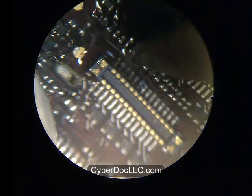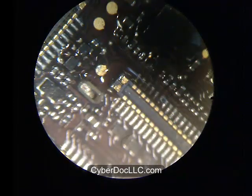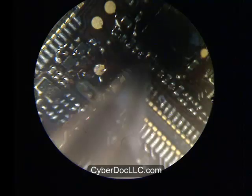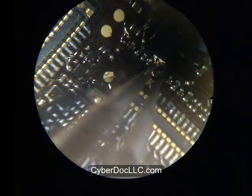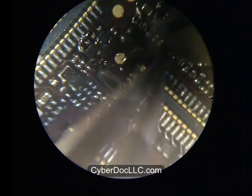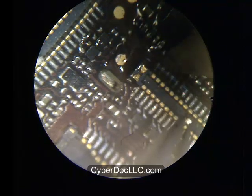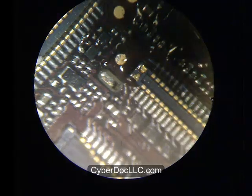I've removed the first filter. This is the second filter to remove — just tease it out, heat it on one side, heat it on the other side with the alloy. On the iPhone 5, you really need to be careful about how you're removing the filter. The reason it's difficult is because there are so many neighboring tiny components right next to it — you don't want to damage any of them, and you don't want to damage the solder pad. Please get some of this alloy when you do this repair. If you buy the entire kit from us, we usually include enough alloy to do this repair many times over.